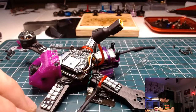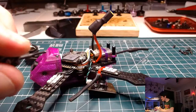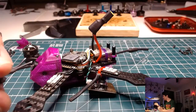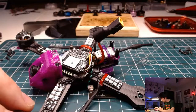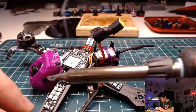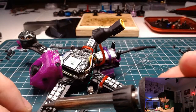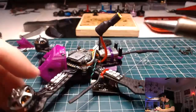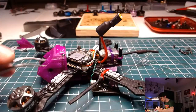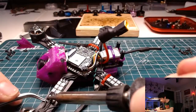All right. Here we go with motor number deuce. Soldering iron, what's happening? Did you cool off? Yes, you did. You know what? I'm realizing what it is. By not using the sponge, I never drop the temperature of the iron down enough for the sleep timer thing to see that it's woken up. And that's why it goes to sleep, because it thinks I'm constantly not using it, because the temperature isn't dropping down as much as it expects it to if someone were using it.